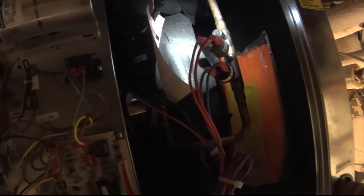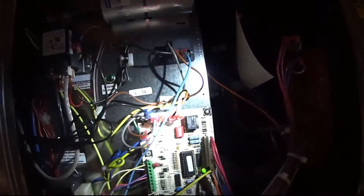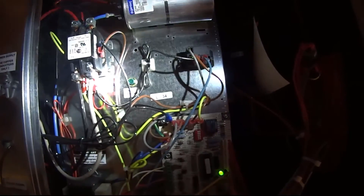That's about it for these units. This is a direct drive - they don't go into defrost mode, there is no emergency heat on these. They basically run as long as you have 80, 85, even 90-degree water temperature. Make sure she's running properly in cooling and in heating, and that's it - you close it up and call it a day for a water source heat pump. In most cases these units are located in some really tight space.